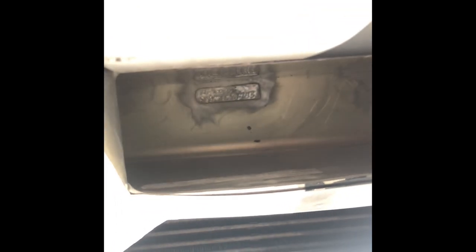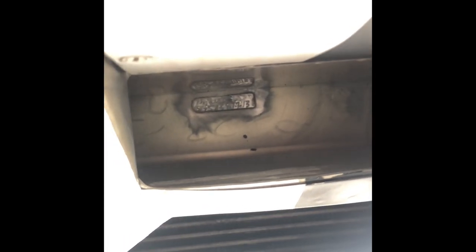Just to give you another view of the back here — this is the back outlet — so you can see the door closing. The engine anti-ice was selected on, but now it's selected off. So the door is coming down, which is why that flap has gone up, and this door is coming to close. There are effectively like two flaps, but the bottom line is it stops the air from going out and it all goes now into the intake. That's where you get the performance improvement.